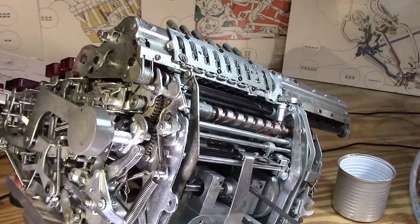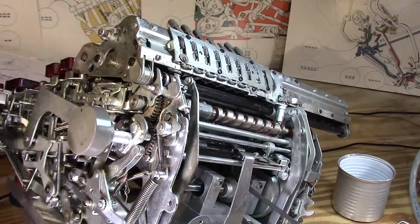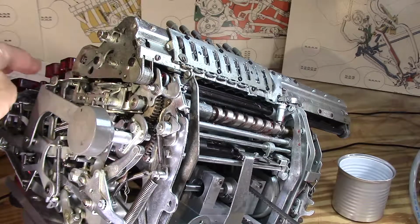And I've been basing the RPM of this motor on the MA series and the something other series that's, you know, quite a few generations earlier, and they were saying about shy of 400 RPM, so I based it off of that. So that's why I was kind of confused as to why this machine seemed to be going a lot slower than I was expecting. So I may build this motor up a little bit further, and then I can run the motor itself at a lower speed, but I'll have plenty of torque. So at least that's a thought in the future. At the moment, it works fine. Yeah, I just maybe can't run it quite as fast as I would like.